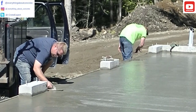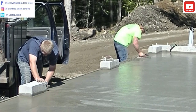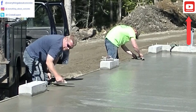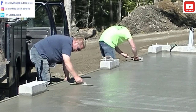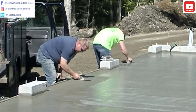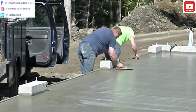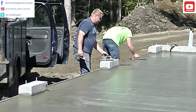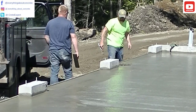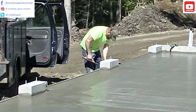Then Darren will finish up cutting his out. You can see they're not hurrying — they're doing this in plenty of time. They've got plenty of time to get it done before they need to get on the floor with the power trowel. When you finish concrete, you just got to stay ahead of it. Now he's magging in his straight line, making sure his slope is looking perfect. Getting these garage doors right is about half the work of making these garages look really good. You can power trowel it and make it look nice, but if your garage door cut-downs don't look good, the first impression from the homeowner is going to be negative. So you can see how Luke did his — it was very similar to how Darren does it. They've both been doing it the same way for years.